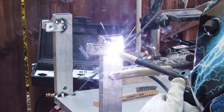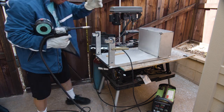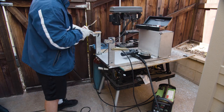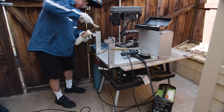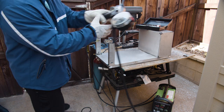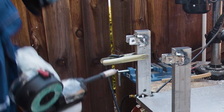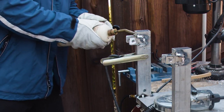We're going ahead and actually doing some welding now. So I had to preheat the aluminum and now we're actually paying attention to the welds. Before it was obviously just tack welds. So it takes a lot of preparation and time here to clean the metal. Aluminum is not easy. You need to brush it, clean it, and heat it, and then push the welds each spot.